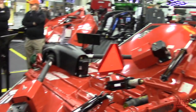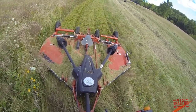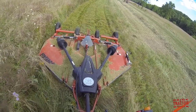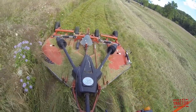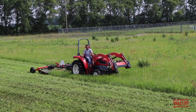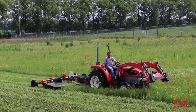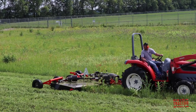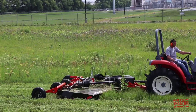What we have here is a smaller flex wing than what we normally have had. It's a 10-foot wide unit, weighs just over 2,000 pounds. The idea is that we can take the same technology in our larger cutters and scale that down for the smaller horsepower tractors. This fits better into that less than 35 horsepower range up to that 50-60 range, to have a cutter that has the full flexibility and heavy-duty components we use off of the larger units for good reliability. It gives that hobby farmer or weekend farmer an option to be more productive with that larger width and still follow all of the terrain contours, just like we do with our larger mowers.